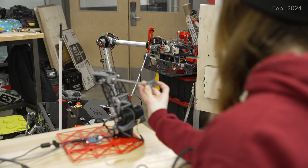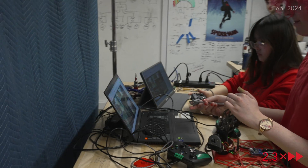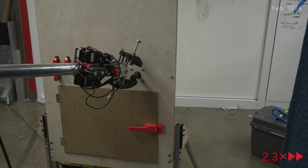We use three controllers to operate our arm. A puppet controller facilitates broad movements such as lifting objects and collecting soil samples, while a gamepad provides precise Cartesian control backed by an inverse kinematic solver.